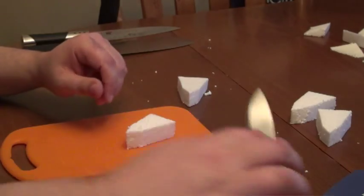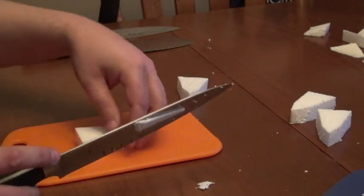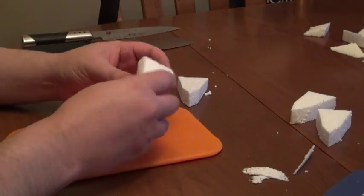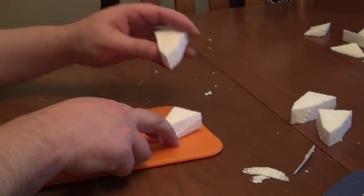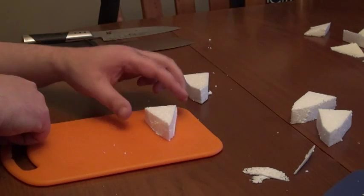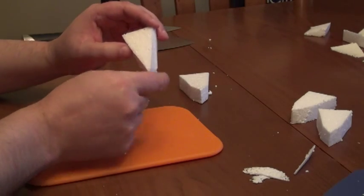What I could have done, which I've done in the past, is simply shave off all that metal. You've got to do it on a grinder because you can't really cut steel that easily. You end up with one smooth taper — no longer a dual taper, just one smooth taper. And all you do, of course, is grind all that off. The problem, though, is that this very edge, when you grind it that thin, is susceptible to bending and cracking under lateral forces.